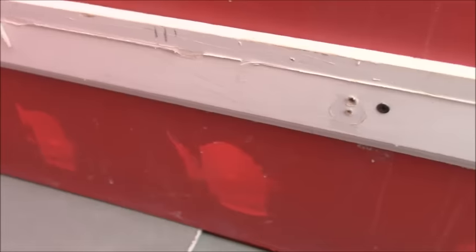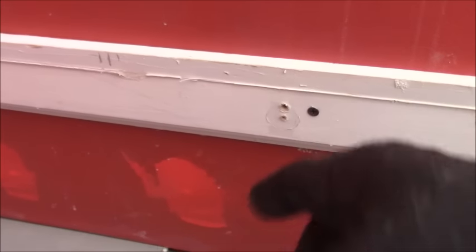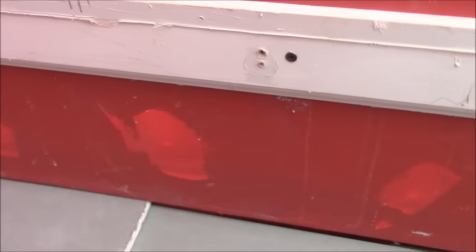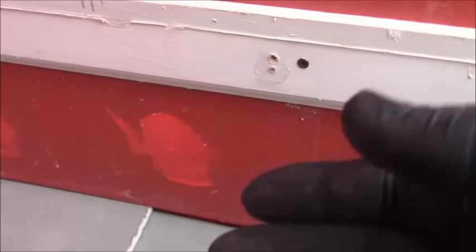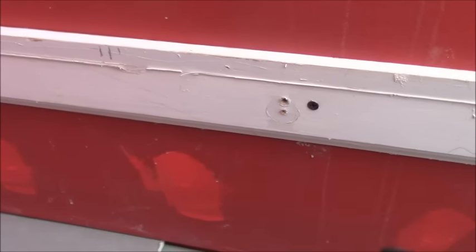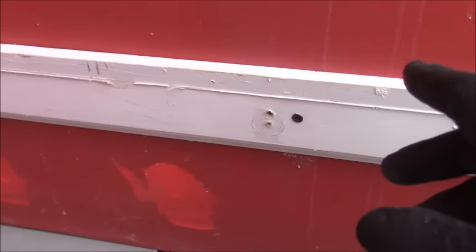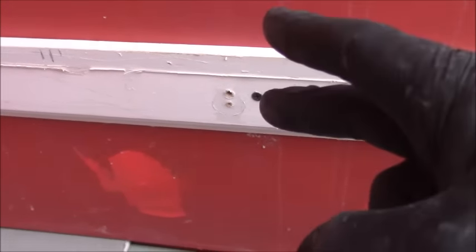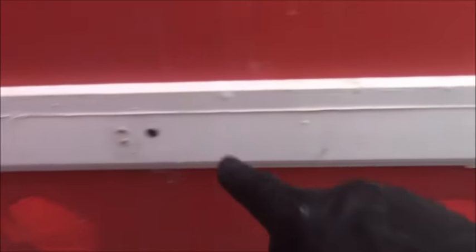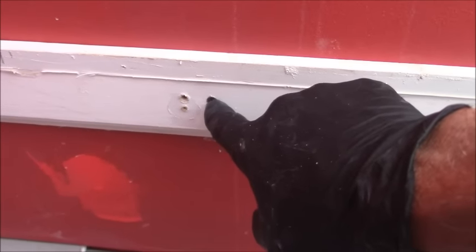A video I posted recently showed a ledger board, and I went through the quick step-by-step process of the reason I use these ledger boards, which a lot of tilers do. So I'm going to do a little more comprehensive explanation of the ledger board. I think the question I had received was, how high up is the ledger board? The other question is, what do you do about the screws that you put into the wall? So I suggested using some silicone.